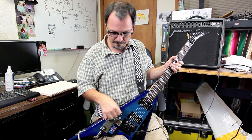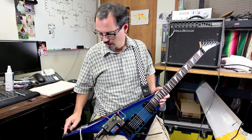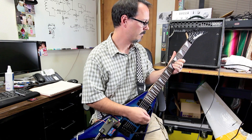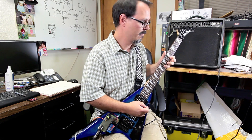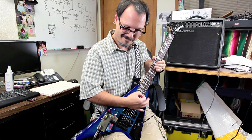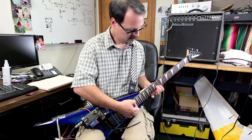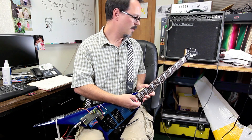There is no reverse polarity protection, so if I put this in backwards these two caps are going to explode. I've got the high end turned down and the low end turned up to get a more rounded sound, because this really does not get the low end the way I'd like it to. There are a few positions I've put this thing into — this one is on the far end. Sounds pretty thin, doesn't it? Now I'm going to try on the other peak — distinctly thinner and more obnoxious sound.